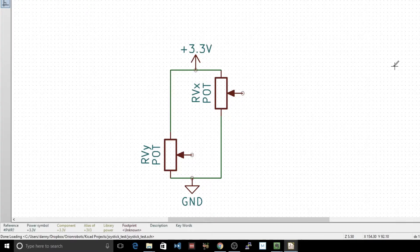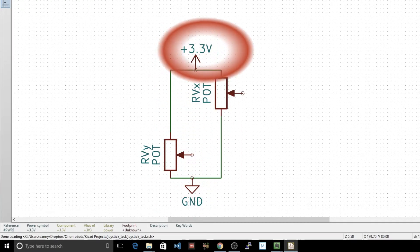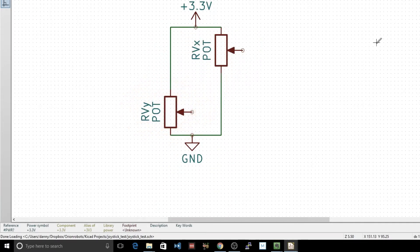However, the fact that this joystick has got two analog outputs and the ESP8266 has only got one analog input led me to think: what ways could I solve this? The analog stick has got ground, voltage in, VRX, VRY, and switch. VRX and VRY are going to be variable resistors between ground and the voltage you put in.